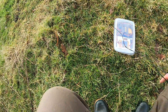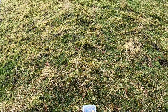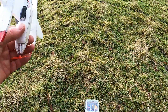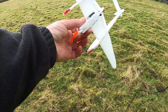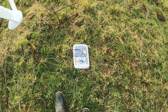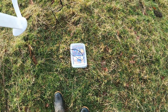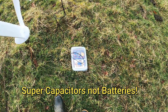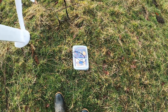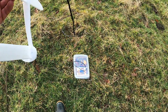I've got my charging box here — an 18 volt battery into a little Chinese circuit that gives me a regulated power supply. I charge this up to about 3.2 volts. Just plug that in and a little voltmeter on there tells me how much voltage I've got in the batteries. It's currently up at 1.5 so I'll take it up to 3.2, which is slightly more than the recommended 2.7 volt rating for the capacitors, but they're very cheap so not a problem if they have a short life.